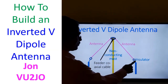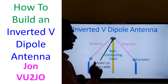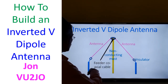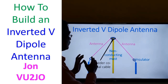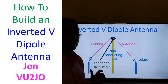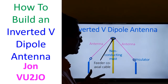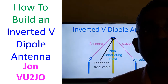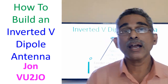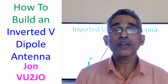For example, the two ends are very near the ground. If somebody touches these ends while the antenna is in use, it could give an RF burn, especially when the power is high. So you need some protection. If you are installing this mast in the garden and the ends are within your compound, you should ensure that nobody will go and touch these ends. These are precautions to take for the protection of your own people and yourself. In the case of a horizontal dipole, this is not required because both ends are quite high and nobody is going to touch them.